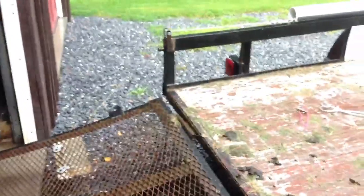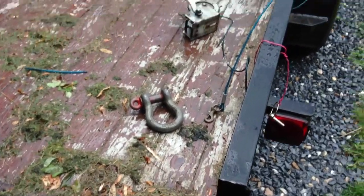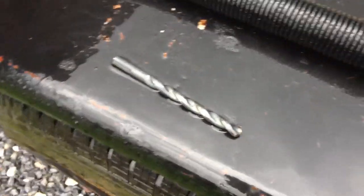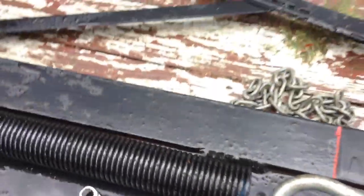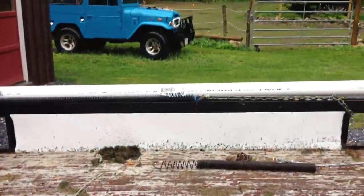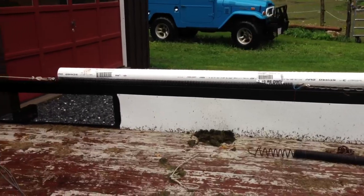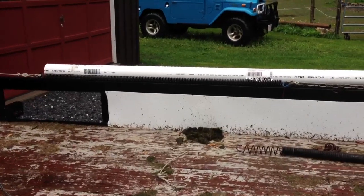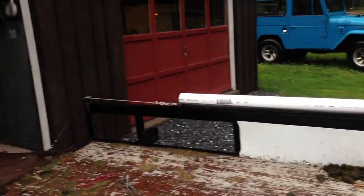The rain's starting to let up. Watch out Ted, dropping the gate buddy — that'll go a lot smoother once the rain stops. I loosened this one up in preparation to drill the hole through here, because this is where my upright has to go through. I've got it at 35 and a half inches on both sides. You can see the line on the other side — that's where the spring is under tension now, and it's not under so much tension that it's a problem. These are just garage door opener springs, well within the range of where those things can go.